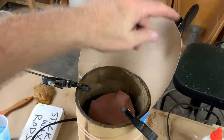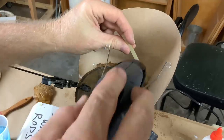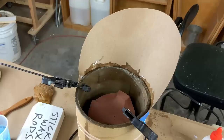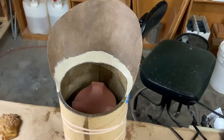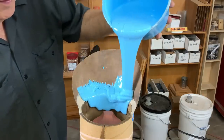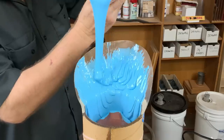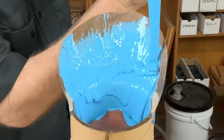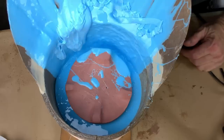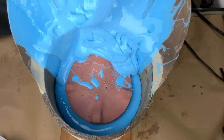What I've done is I just took some very lightweight cardboard and built myself a pouring funnel. This is going to allow me to dump-pour very fast. I need to seal it on there with more wax — once that cools, that's really going to bond it on. I finished off the funnel with clay, made a nice tight joint. Now the rubber can just flow right in fast and easy. This mold is going to weigh about five pounds, so it's quite a big chunk of rubber and it's got to be poured quickly. You don't want to drape the model with rubber or you'll catch bubbles. I need to direct the rubber down this narrow channel — that's where this funnel just works. It's magic. It allows the rubber to flow down the back wall and drop all the way to the bottom, then fill the mold from the bottom up, which is what we always want.